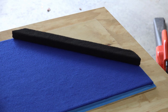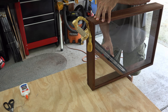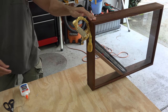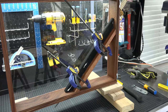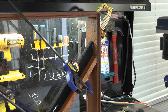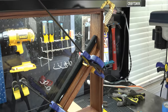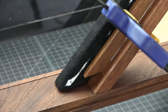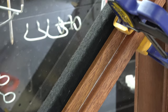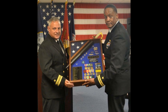Normally, I would mount this piece right on the blue backboard, but as I say in every video, I make this up as I go along. So this time I have decided to place the piece up high directly under the cutlass. I will start by leaving the sword in the box and placing the piece up against it, simply gluing it to the ends and crossbar, and keeping it in place with a couple of clamps. To give it even more support, I will glue in a piece of scrap wood directly below the felt strip, and I also put some extra glue on the side that makes contact with the felt. I think with the black felt this close to the cutlass blade, it really makes it pop.